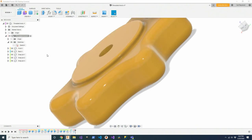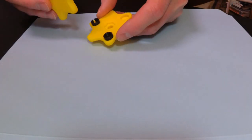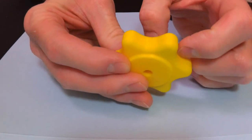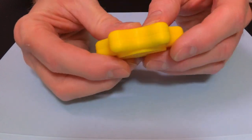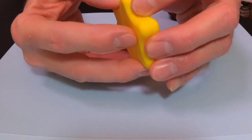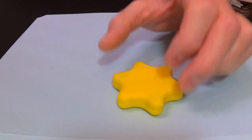I've got my front and my back all finished, and my three snap pin copies. The only thing left to do is a little chamfering on the bottom surfaces — the surfaces that print down on the 3D printer plate. I always like to put a little chamfer there so that if there is any flash it won't interfere with the part going together well, and if I put a nice edge here it'll be possible to get it back apart with your fingernails once it's snapped together. I've snapped this together and apart countless times and it's still snapping okay.